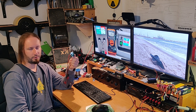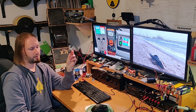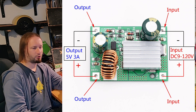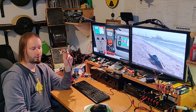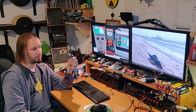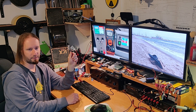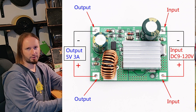You can find these on eBay, AliExpress and similar websites. It's a cheap one, let's find out if it's any good. It's rated all the way up to 120V DC for the input. The output of this one is rated 3A, although you have different versions — up to 90V, and output of 12V or 5V, in 2A or 3A. The 2A version doesn't have the heatsink. My unit is a 5V 3A output with a 120V DC input.